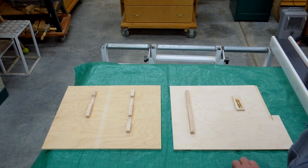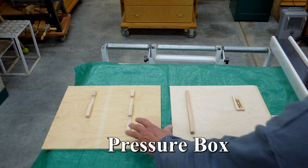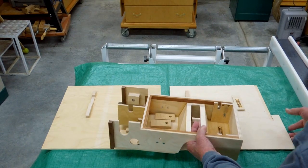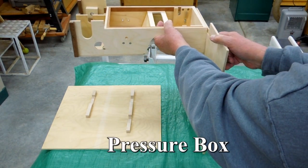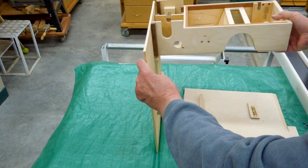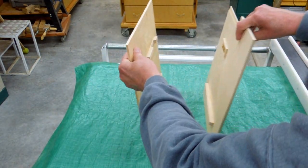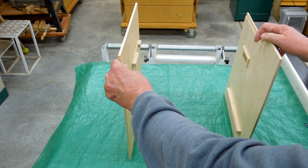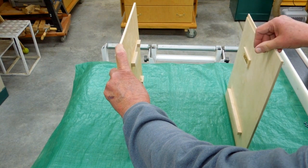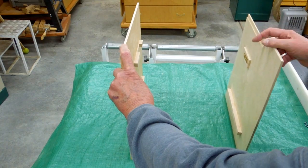Making the case is fairly simple — two pieces of plywood. These two supports go underneath the air box and these two hold up the bellows in the reservoir. The air box fits in here like that and fits in on this side like that. These are attached to the air box; this sits down in the base and then there's a piece that goes across the front to support the pipes and the back of the organ, and in my case that holds the motor.